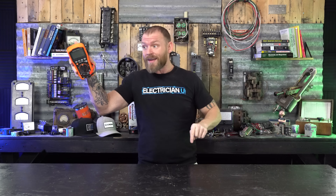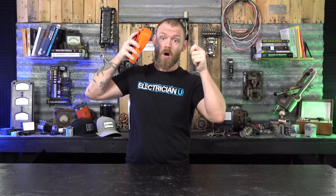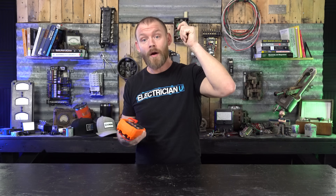It's required that you know thing A and thing B and what they are, because sometimes in a circuit or in an environment there are multiple different things that you could have voltage between, and you need to know how much voltage you have between everything. In a three-phase environment, you might have something that's a center-tapped delta where you've got 240 between all three of your different phases — A and B have 240, B and C have 240, and C and A have 240. But if you test between neutral or ground to B phase, it might show 208. You need to know that so that you don't start putting breakers and single-phase loads on a 208 circuit.